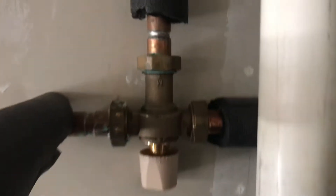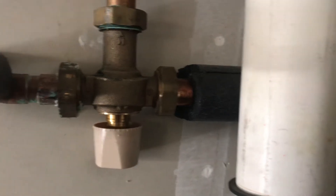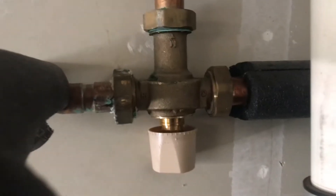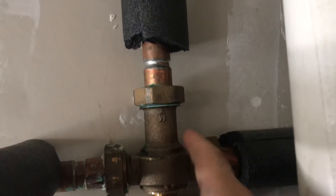Now in the great state of California they put this valve on here, and what this thing does is mix cold water. Here's the cold water side — the cold water is coming in this way. Here's the water from the hot water heater and I can feel it's pretty hot. They mix in cold water so the output temperature here will not exceed 120 degrees — that's what they say it should be.